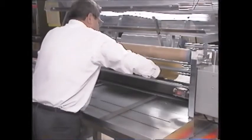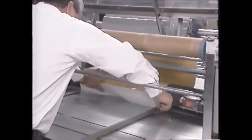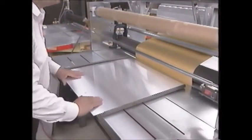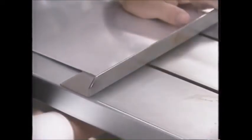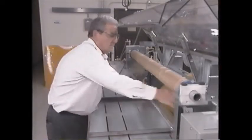Place the sheeting into the gap between the lower nip roll and the feed table. Center a sign blank with the sheeting and square it up with the nip. Slide the edge guides to the blank and secure them, leaving about 1/16th of an inch gap for size variation.